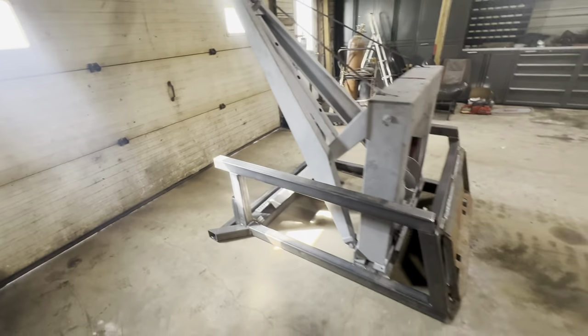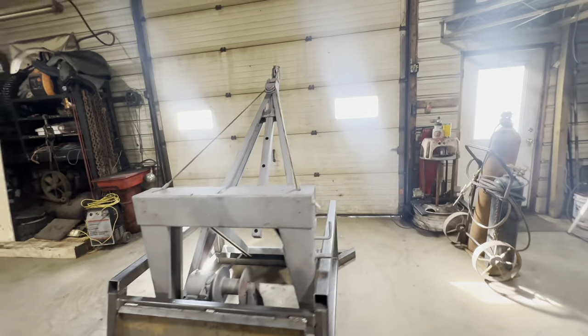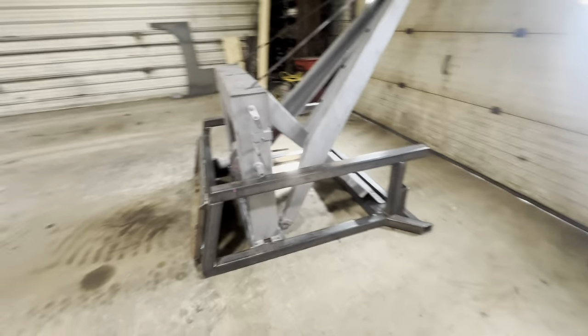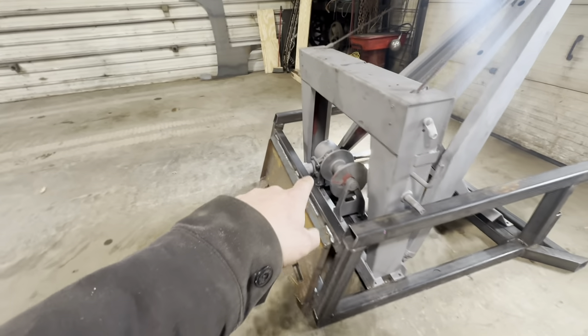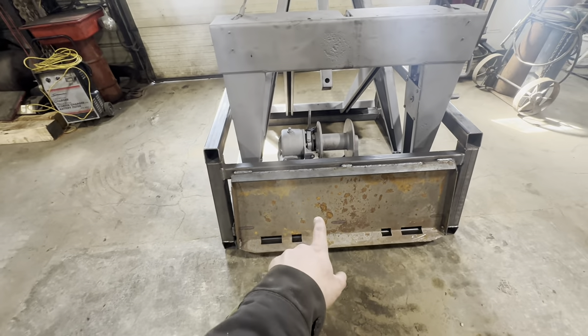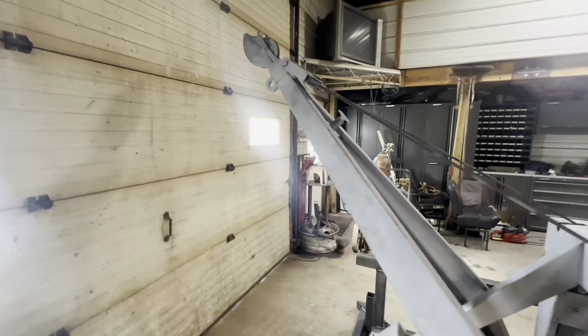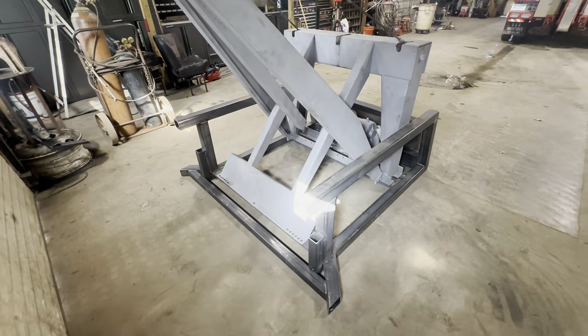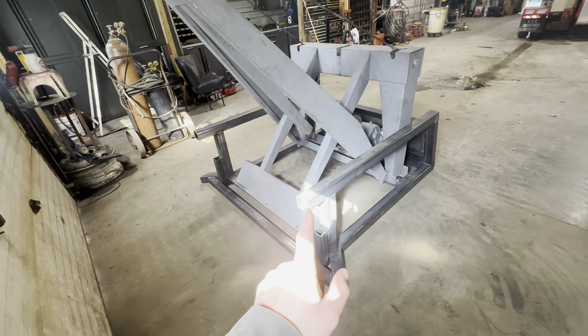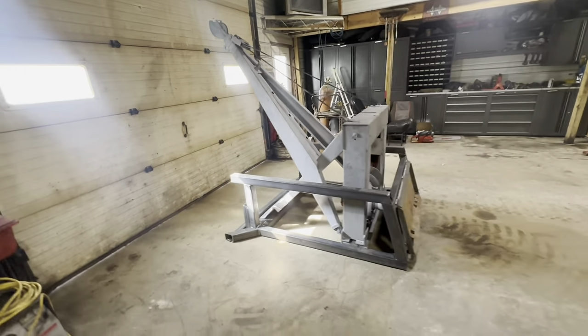The front will just have a cutting edge. The orbit motor sits on the back side of this winch, so I've got to build an access hole through the quick plate just in case you ever have to change it. But yeah, here it is — working and looking pretty good. I'm gonna continue on, and hopefully today I can get the blade built and bolted down, and the access hole done. Then really all it is is plumbing and some chain racks and it's done — a pretty quick little project.